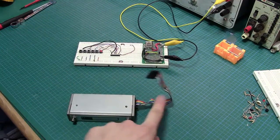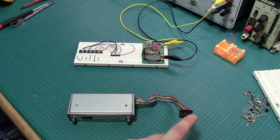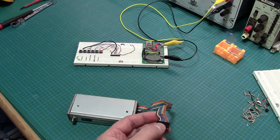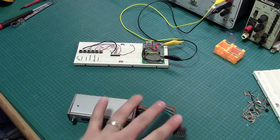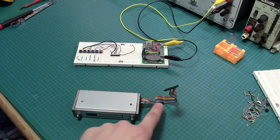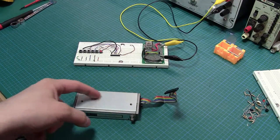So it's digitally controlled. Here's the control connector. It's an 8-pin connector, I think. Yeah. And not all wires, of course, are used. There's a gray wire and a green and a yellow that are cut. All the rest are actually plugged through here. And so we'll use our breadboard setup here to provide signals to the attenuator to be able to bring the pads, the attenuation pads, in and out.